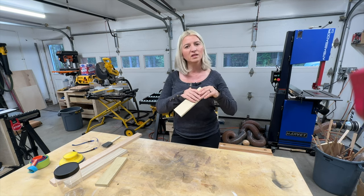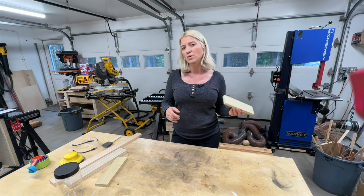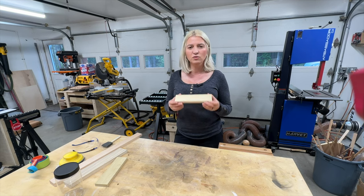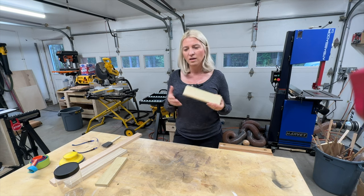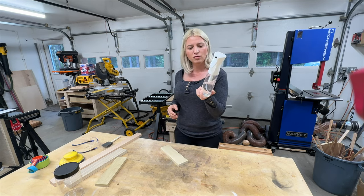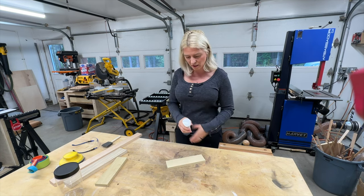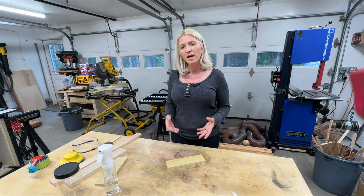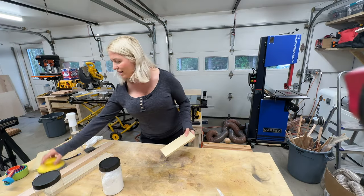After we use the oxalic acid and remove the green, we can't sand too much because the oxalic acid only removes the green from the very top layer. So you can give it a little sanding afterwards, but you wouldn't be able to go through all the grits or take it to the planer. You really want all your pieces at their final dimension and sanded to your final grit before applying the oxalic acid. To raise the grain, I'll use my water bottle — a hairdresser water bottle that gives a very fine, uniform mist. I'll mist the board, let it dry, then come back and sand it again with 220 just to knock off that roughness. My board is dry now, so I'll give it a quick sand with 220 — it doesn't take much — and now we have a nice smooth surface ready for oxalic acid.